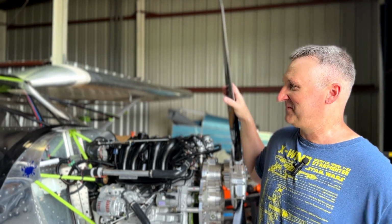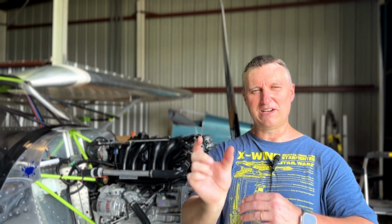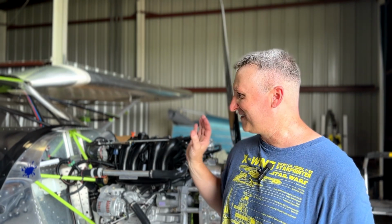There's also a pitch ladder on the EFIS screen, and I'm trying to find a happy place for that as well. I have a hard time finding it, and I'm starting to tweak it. You're supposed to tweak it at cruise RPM, and you can raise it up and down. You've got so many indicators on that EFIS screen. It's just different than what I'm used to. I don't know if I love it yet. I'm hoping I'll learn to love it, but I'm still playing with that. Until I get that down, it's hard to get accurate data for everything else, like best climb and best descent.